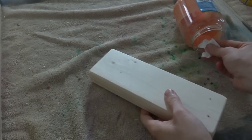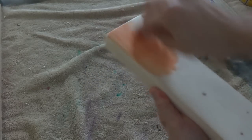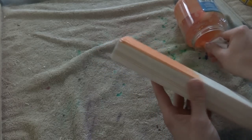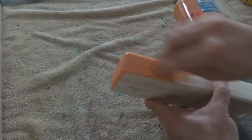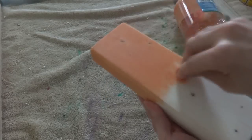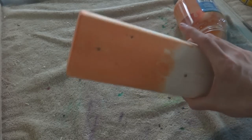For my color wash, it's pretty simple — I actually have a video that shows how I made it. I'm just washing the boards like this. What's really cool about this color wash, or color stain, is that you still see the wood grain through it. It's almost painted, almost stained — somewhere in between, but a really cool look. The ends soak up a lot, so make sure you get them really well — the end grain will really soak this up. Make sure there are no white spots showing and it's totally covered. You could use regular stain, leave them alone, clear coat them, spray paint them — you just want to make sure when they're done that they're nice and slick.